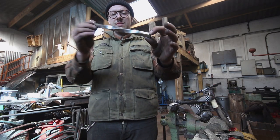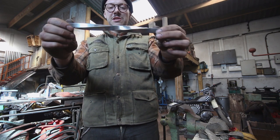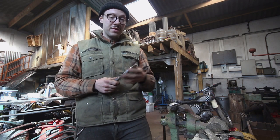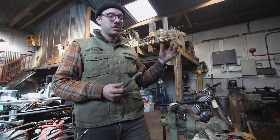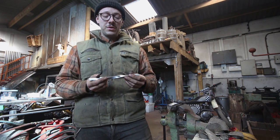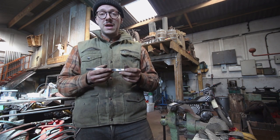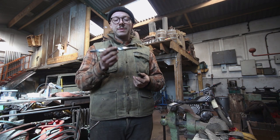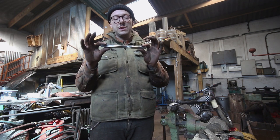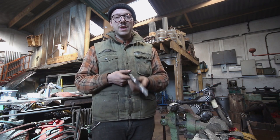That's the twist done. It's come out pretty beautiful — I love doing stainless twists, they just look so good. Now the next thing I need to do is bend it so that it's going to fit both on the frame and also to the brake plate. This is where that little bit of welding wire I used earlier comes in handy. I'm going to heat this up and bend it to match the welding wire — the reason I'm heating it is because I'll be able to get a tighter bend. It's not necessary for twisting but it is necessary for getting a nice smooth tight bend.